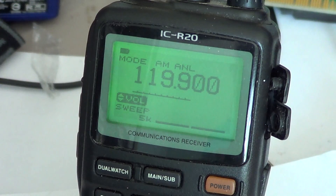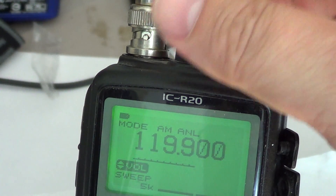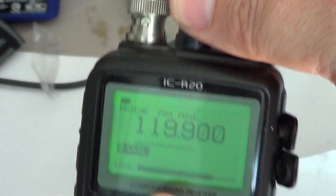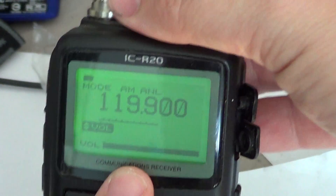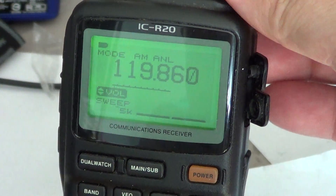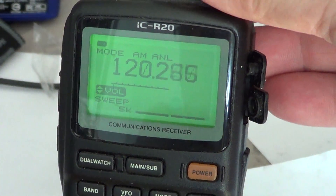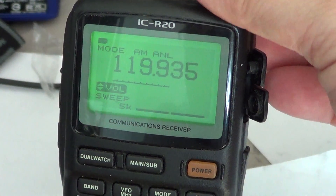This is the Montreal Tower for the departures of the airport here in Montreal. It's very easy to use this scanner. On the top of the scanner you have two buttons. While you are not touching anything, the left one is for volume — you can see the volume going down or up. The right dial button on the top, while you're not touching anything, is for changing your frequency, like a big tuning knob. It's a digital type of button so it goes continuously — this is your VFO for tuning around the receiver.